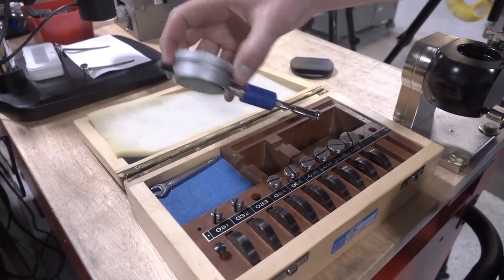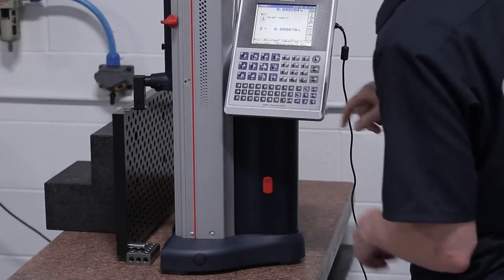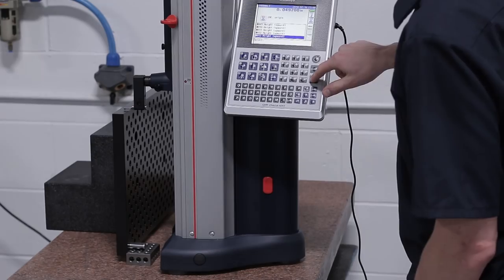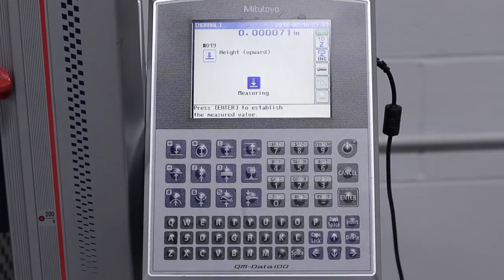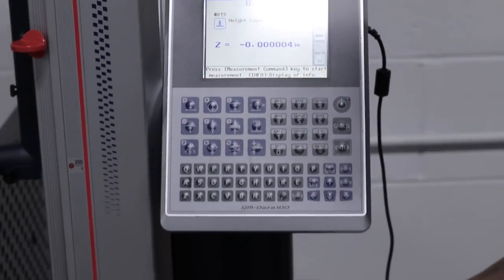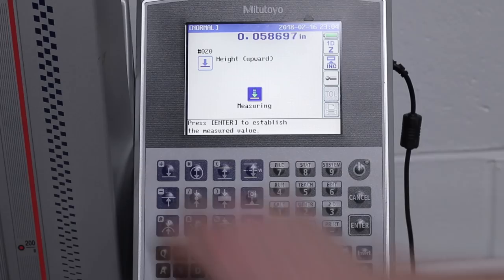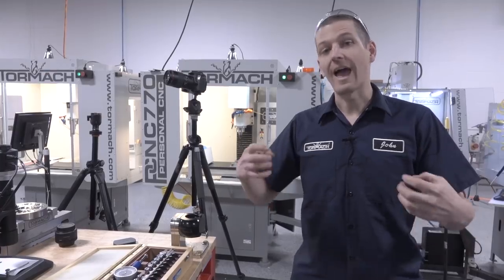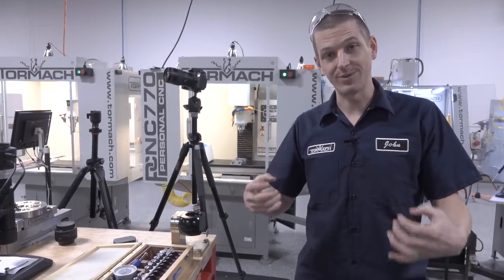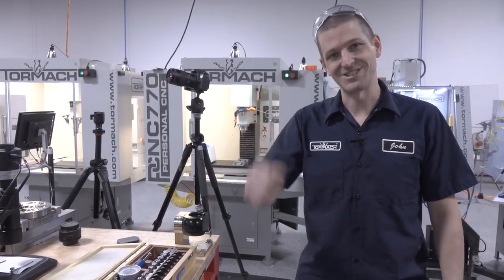And finally, as part of our final QC, we use our Mitutoyo height gauge. That can tell us bore diameter and it can tell us the location of those bores — distance on center — ensuring they're well within tolerance along the X and Y planes, as well as relative to the outside of the plate. So folks, hope you learned, hope you enjoyed. This is what I love: it's technology, it's being creative, it's being smart, and it's creating recipes and processes as we want to create these holes and these plates and do it super well. Thanks for watching, take care, see you soon.